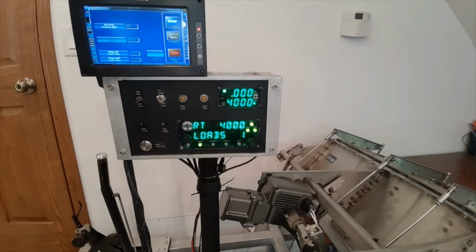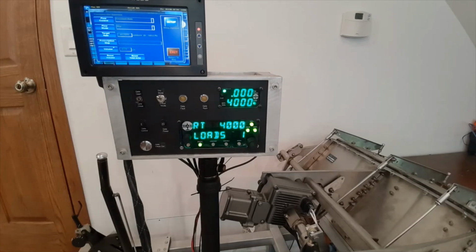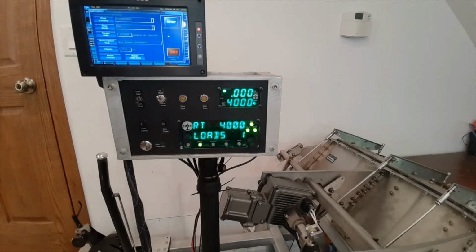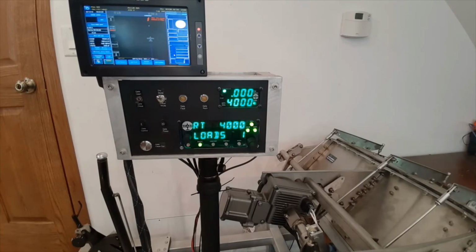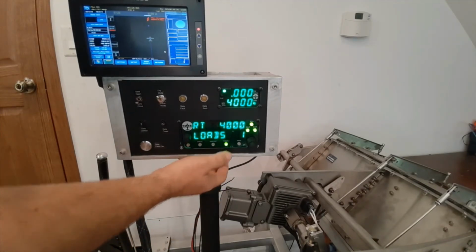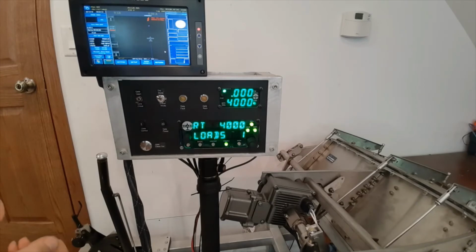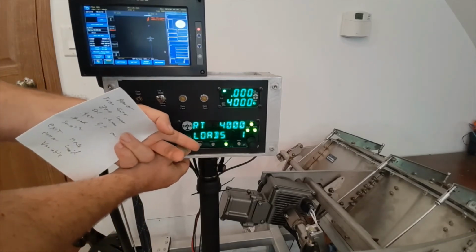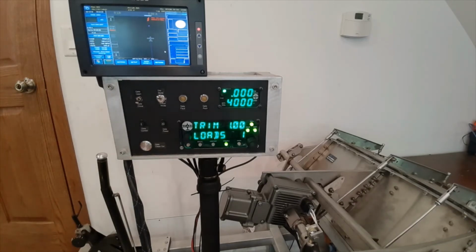We're going to go back and back, and now we're going to select the prescription we're going to use. Again, we're working with the potash. Accept. Exit. Now we put the unit in variable mode, and when you're flying it automatically selects flight. I'm going to force flight here by holding Alt and pressing the button. Now we're in a forced flight mode.